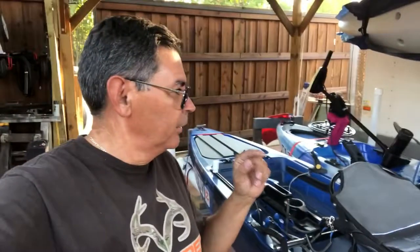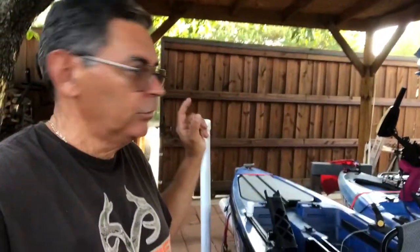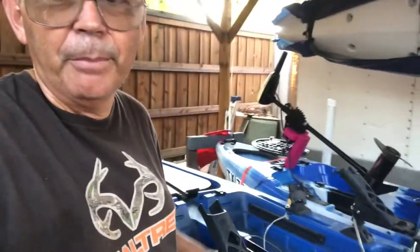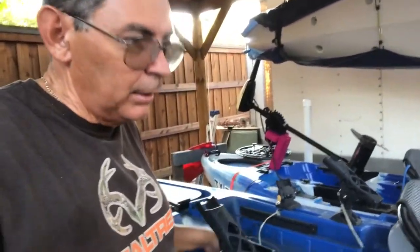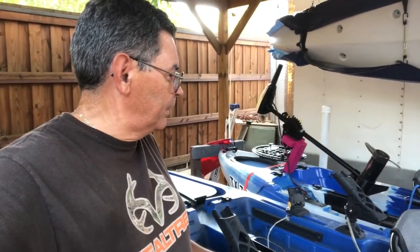I'm gonna be mounting the camera on my hat so you can see me as I work. The two things we're gonna do today: this kayak now has to have all the lights. There's one light already here that mounts in the back of the boat — that's the anchor light — but when you're moving you have to have the green and red navigation lights. I'm going to be installing that, and we're gonna upgrade from my Humminbird, which actually comes off my bass boat, so it's got to go back. I'm actually gonna put a new Lowrance sonar with GPS on here so we can map where we've been — it'll have newer features and be easier to see in broad daylight.